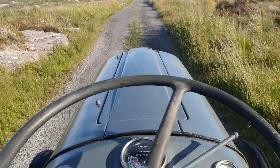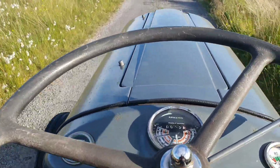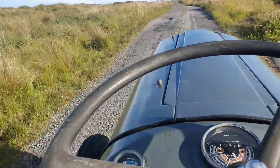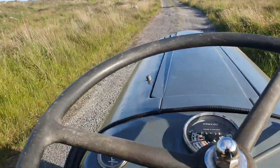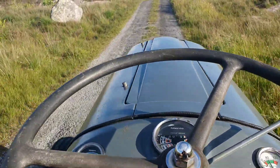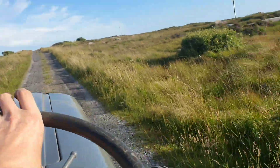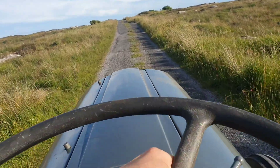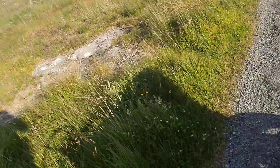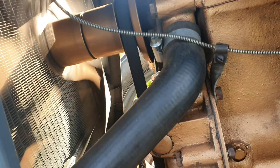Get it into top gear first. We're sitting at 1000 revs — let's see if it's able to hold. It's going up now to 1200. Let's see if it can hold around 1200 here. This is where I want to see it working, especially at this steep hill here. Is it dying? We're definitely not what you would call governing. It does catch up with itself — fair enough — but that's only when the pressure comes off and then it revs too high, which is not where you want it.